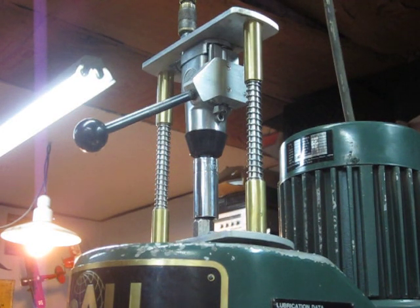A while back I figured out I'm spending way too much time cranking drawbars in and out, changing tooling on this mill. So I got busy and put together a little power drawbar based on one of these little $19.95 Harbor Freight special impact wrenches.